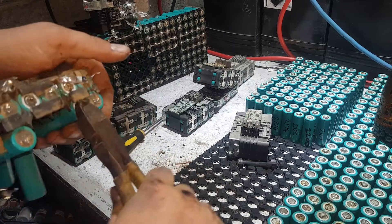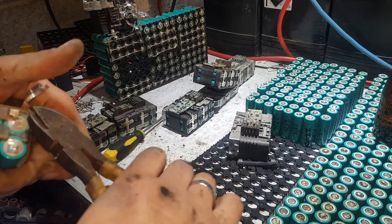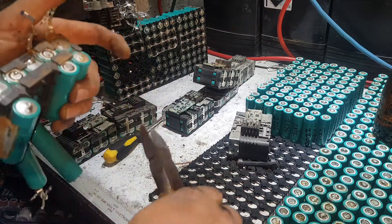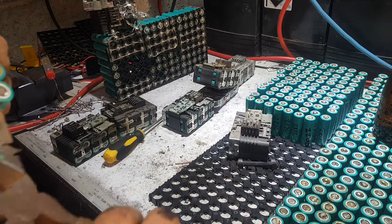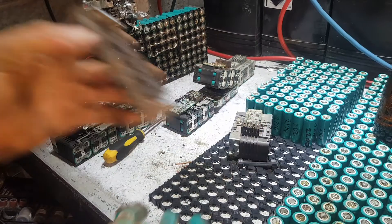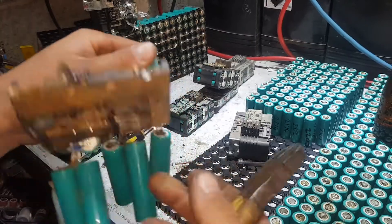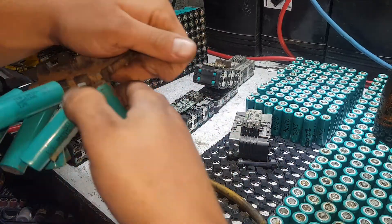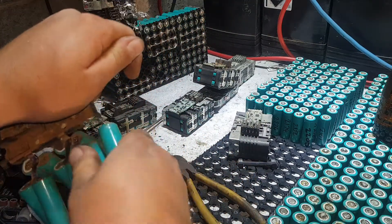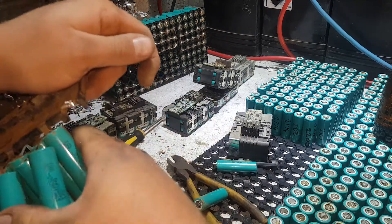Get your side cutters and rip those strips off. Get all those tags out of your way — you don't want to be dealing with them. Once you've done that, your cells will fold over. Grab that divider out and the cells will fold out. What I tend to do is grab them in groups of two, three or even four, and twist — that'll break the cell connector.